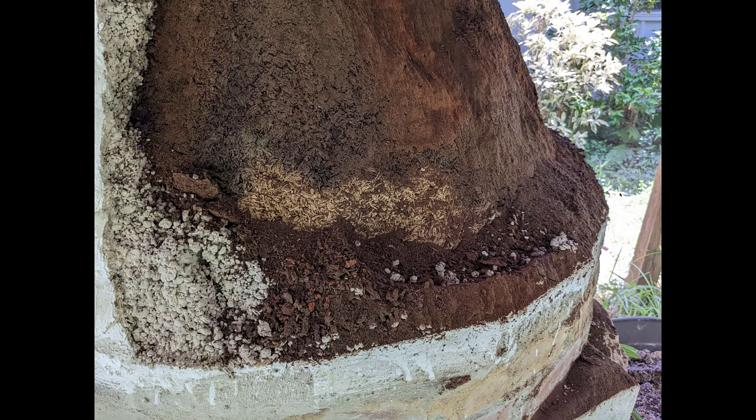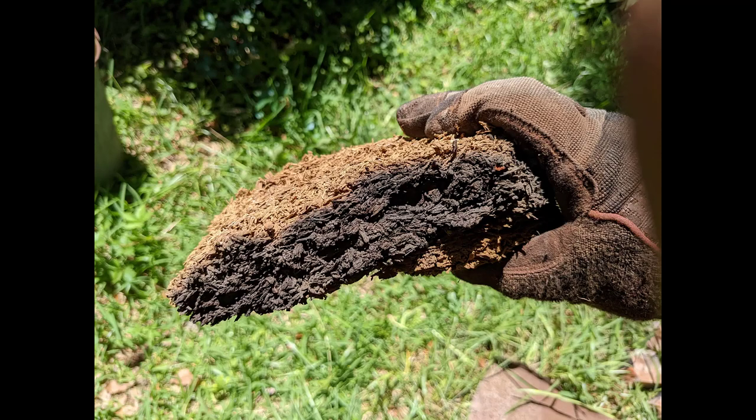Here's a picture of the middle insulation layer, and you can see it's not even dark — it's totally untouched by heat. That was one of the questions I had, and I think other people had too: what happens to that mass in the middle when the dome gets really hot and transfers heat to it — does it burn up? Even if it totally dried up and turned to powder, which is kind of what it did, that's okay. If it totally disintegrated, it would still be fine because essentially there's a trapped air layer in between that's acting as insulation. Here's a place where the insulation did actually burn, and I think that was right up against the chimney. But even then, as long as there wasn't an actual fire from it, it doesn't really matter.